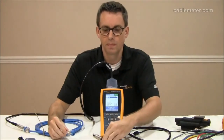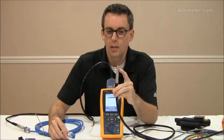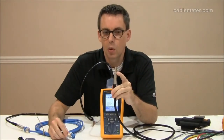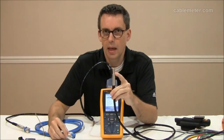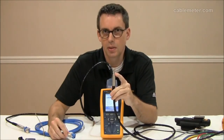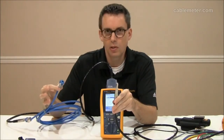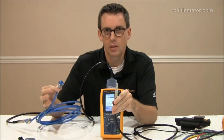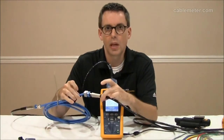The other part of the secret is the PLA002, my test lead here today. This plug on the end you'll often find in connector vendor hardware labs. The reason why is this plug actually meets the test plug requirements for connecting hardware in the TIA and ISO IEC standards for crosstalk, return loss, and insertion loss. The manufacturer is required to tune this jack to a TIA and ISO IEC plug. So if this is a TIA ISO IEC plug, guess what happens when you mate them together? You get the perfect marriage.